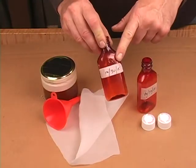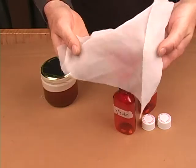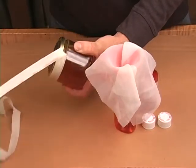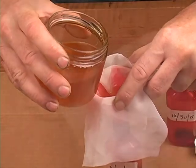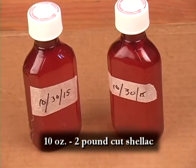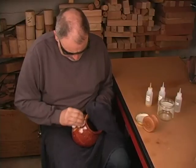Keep track of the date that you mix your shellac by dating the storage bottles. You'll need to strain the shellac — for this I'll use a piece of sheer curtain. The liquid flows freely through this material and filters out all of the impurities, like twigs, bug parts, and undissolved shellac. This mix nets me about 10 ounces of liquid shellac — that's a 2-pound cut, which is perfect for French polishing.